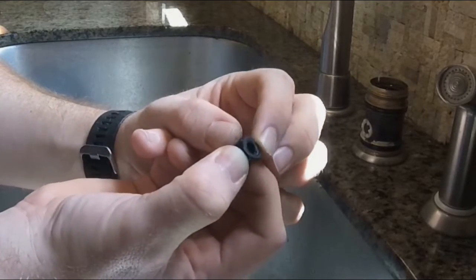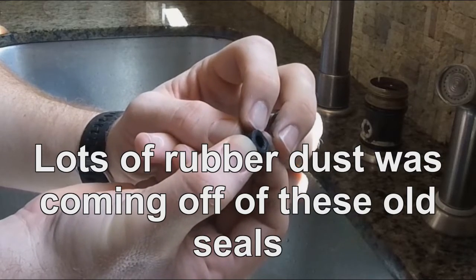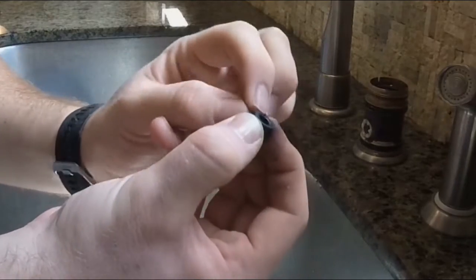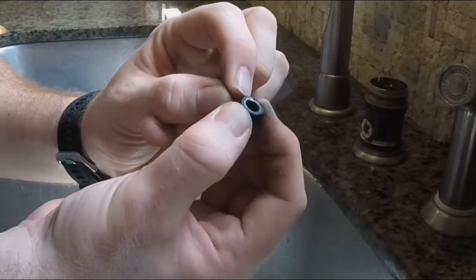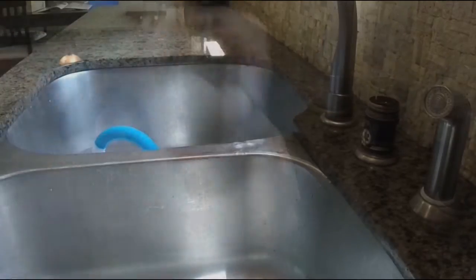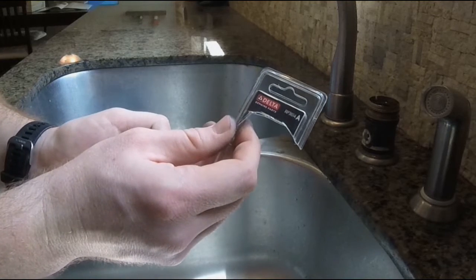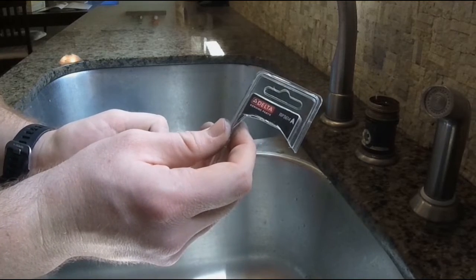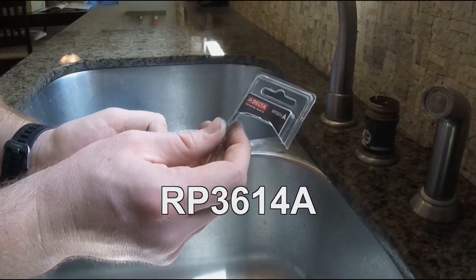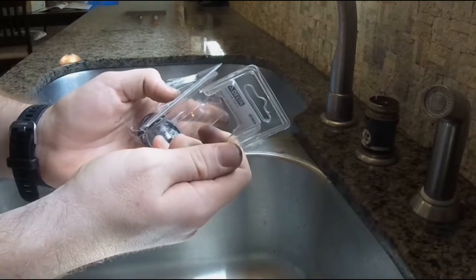Now that you have that O-ring out, look at it and you'll probably see quite a bit of wear. Mine looks worn out — it has a cupped shape to the sealing surface because it's been riding on that spherical ball valve. Every time you move the lever forward, back, and side to side, you're rubbing on this sealing surface, and this is what wears out and causes your faucet to drip. This is the parts kit I got at the local Lowe's — Delta Genuine Parts, part number RP3614A. It has a bunch of miscellaneous parts and fit my sink perfectly.